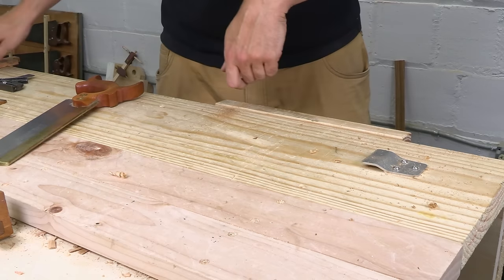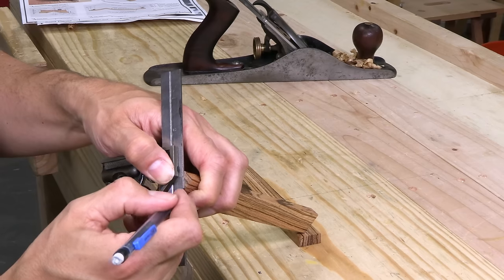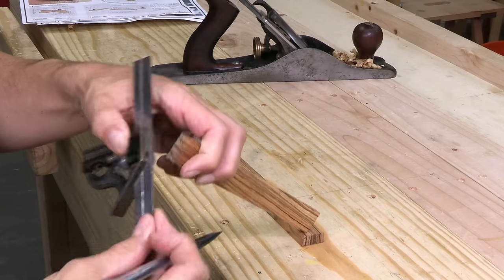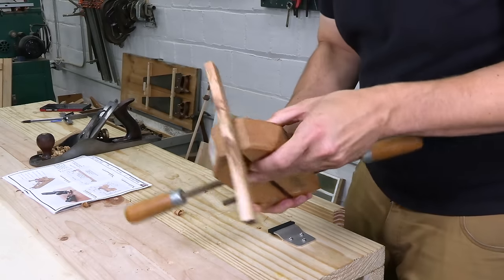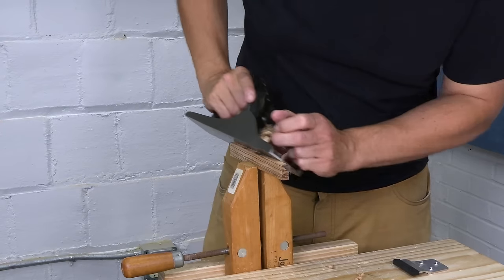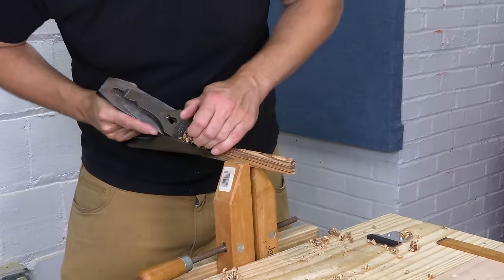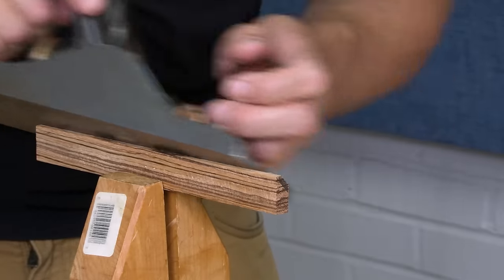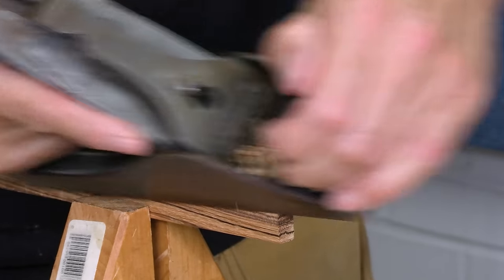So I remade them out of this exotic wood — I think it's snake wood, but I really don't care. Now we need to plane the 45-degree chamfer angles onto the inside of these two pieces. I lay out the angles with my combination square, but these little pieces are difficult to hold in a standard vise. So instead, I grab each one in a hand screw and put that in the vise. The hand screw puts huge pressure on a tiny area, so I can hold this little piece very firmly. And it's also elevated, so I don't have to bend down. This is basically hands-free chamfering without a chamfer plane. It's not difficult, but you do need to watch your layout lines, especially on the ends, so everything stays parallel.